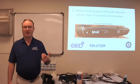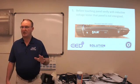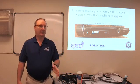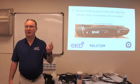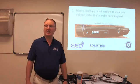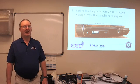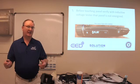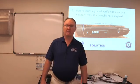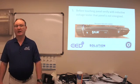Pay attention to how the panel opens, because if we do get an arc event, that door is going to swing open. The major arc event I was involved with on the 4160-volt panel — five things lined up perfectly for it to happen. It started with a ground wire that swung loose and ran into one phase of the 4160, causing a phase-to-ground fault, which changed to a phase-to-phase fault through gas ionization. On the wall in that facility, you can still see the outline of the individual — they haven't painted over it yet. It does leave an imprint, and you get a heck of a blast.